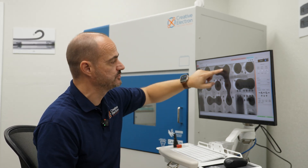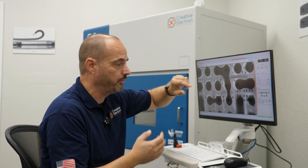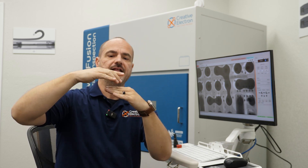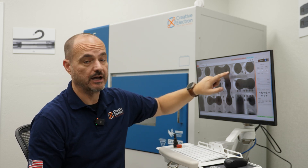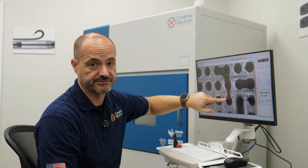Another reason is mechanical: this region of the BGA may be too close to the board, pinching down and creating a lack of height between the BGA and the PCB. With a specific volume of solder deposit, if that height is not correct and you squish it, the width and length of that deposition grows, which can create a connection resulting in this big blob of solder you see here.